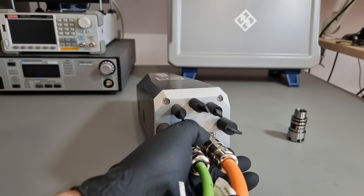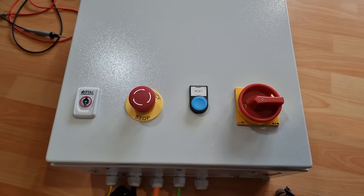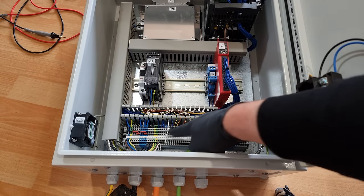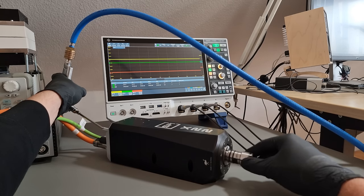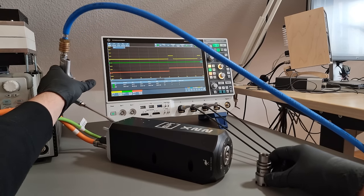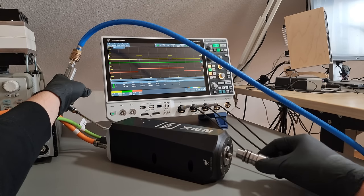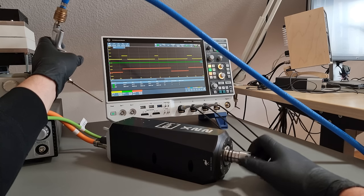There are a few — this X22 is fully loaded as far as I can tell. In the basic X Control E cabinet, most of these optional signals are simply brought out to a terminal strip but not connected to anything yet. There are three outputs for supervision of the automatic tool changer system, telling you whether the ejection piston is out and if a tool is clamped or not. Those signals are useful to implement fail-safes in longer multi-tool programs — you wouldn't want to try and load a new tool while accidentally there is one in the spindle already, or skip an entire operation because the previous tool failed to load. So these three signals are useful primarily together with an automatic tool changer.